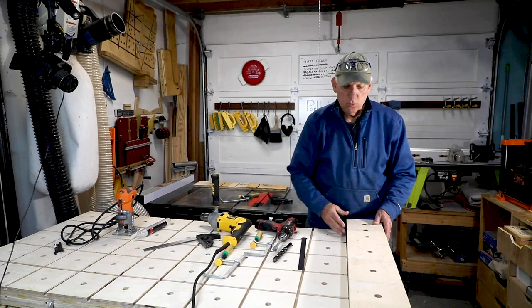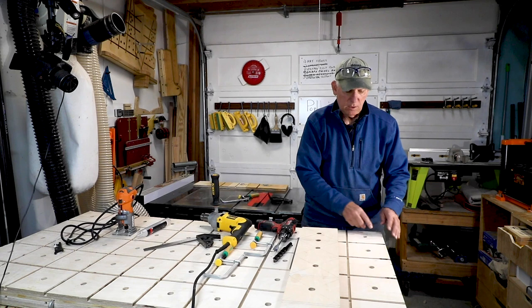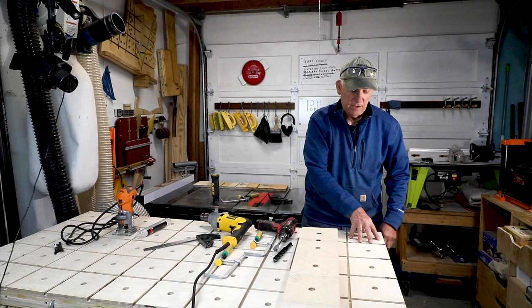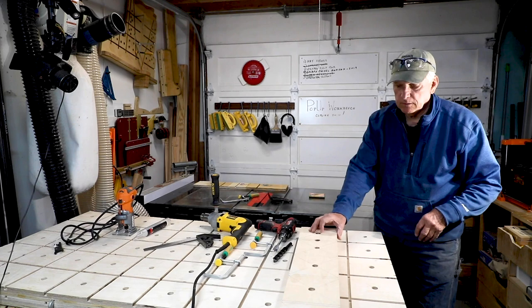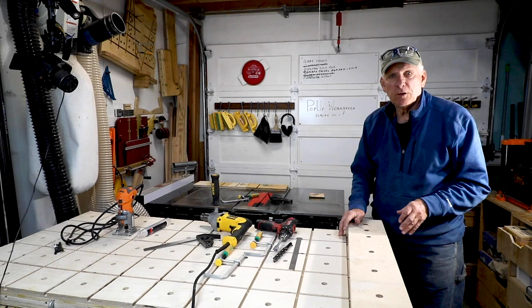You take, in this case, the base, and I drew lines across, again, each is squares. I did that on the jig, but I did that down here on the base as well. And so that gave me the center. And I only needed to do that on the 2 outside edges. Because this jig's not flexible, if I get the 2 outside ones lined up, then I should be good to go for the rest of them because these are lined up.